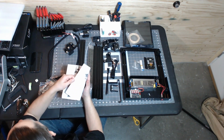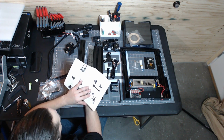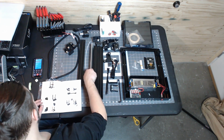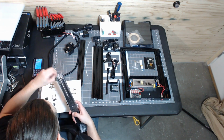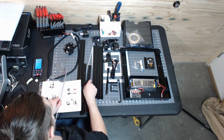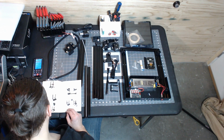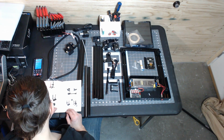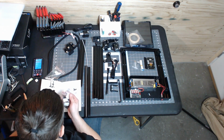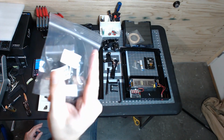There's not even a part breakdown. Nothing says you should have this many of this and this many of that. Number 3, product installation setup. Install Z-axis profile rings. All right, so this has a threaded rod, so I have to move this thing. Place the chassis module on the horizontal table and fit the two Z-axis profile rings to the chassis module with screw M5x20. I'm not totally a metric dude. Okay, well there is a small sticker here that does say M5x20.